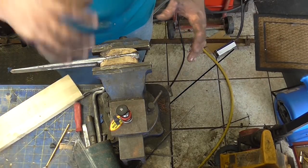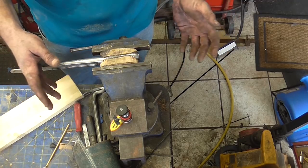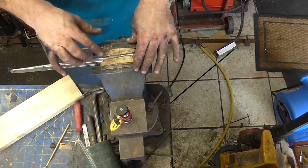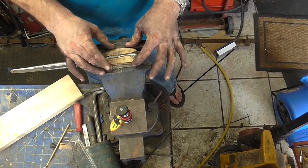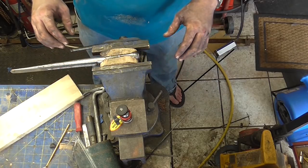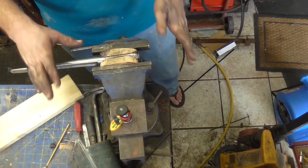Alright, so we're going to let this drip epoxy all over my workshop for approximately a day. And then I'm going to come back and drill the other two holes out, sand it down till it's some rough size that I'm sort of happy with. Then I'll install the brass, then I'll start shaping and finish sanding it, and then peening the brass out. So, day one.